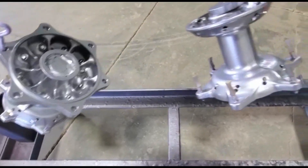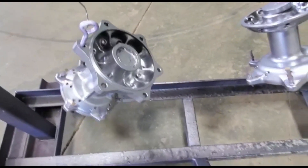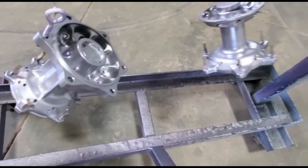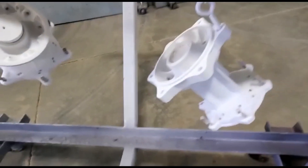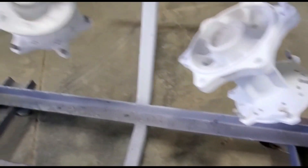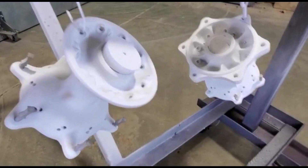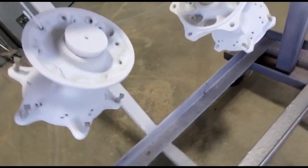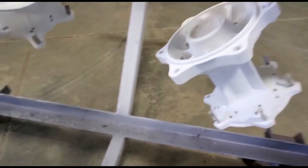This is the illusion purple just out of the oven. As soon as it cools down I will be spraying the clear coat on. The clear coat dry film is white — it comes out as a white powder, and when you put it in the heat and it gels, it's going to turn clear, which will also activate the purple.